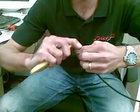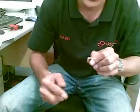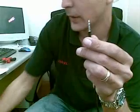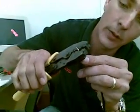First thing: remove up to four millimeters of the outer sheath, the inner wire mesh, and the white plastic — it looks like that. Take your little ferrule, put it over the cable like so. Take your LMR195 crimper and crimp it.